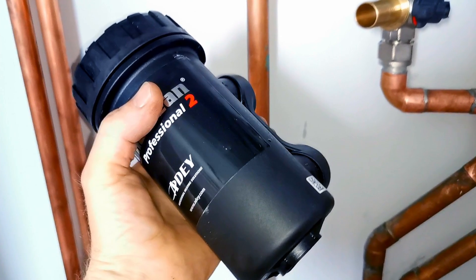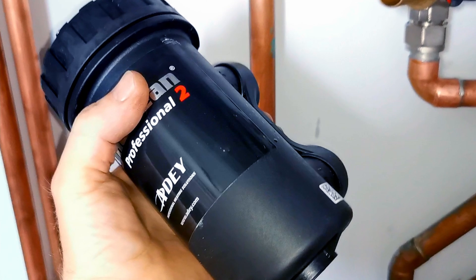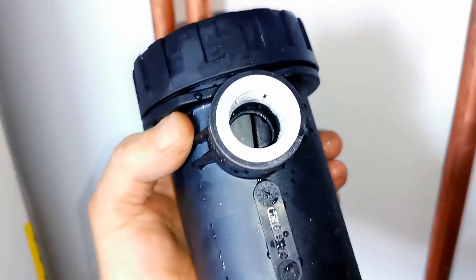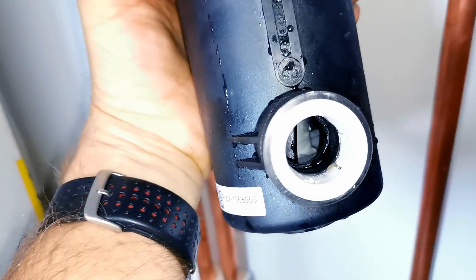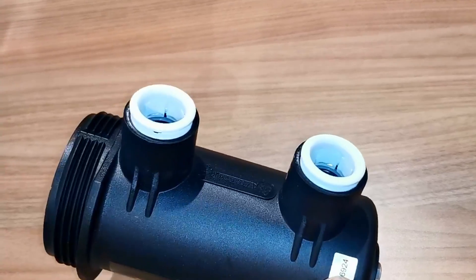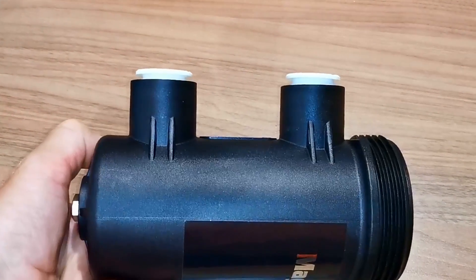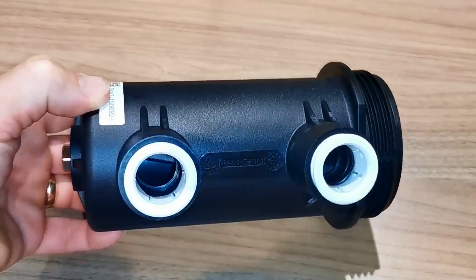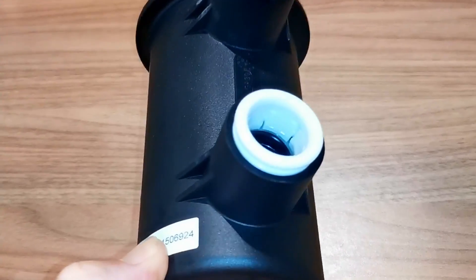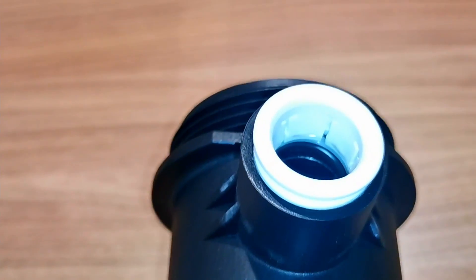Although we have drained the water out of the MagnaClean, there is a recess in the bottom with a good quarter of an inch of water, so as soon as you take it off and tip the pot, that water is going to run out — you don't want that dripping on your carpet. On the MagnaClean pot or canister, there are speed-fit connections onto the valves and there's no easy way of servicing those. If it leaks from there when refitted, all you can do is replace the whole canister. That is one reason why I would not remove the canister unless I have to. Rubber o-rings over time go hard and flat, and if you disturb them after many years there's a good chance they'll leak if you try to reuse them. Good engineers will always replace them wherever possible.